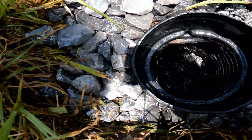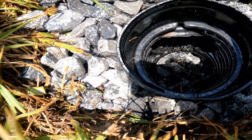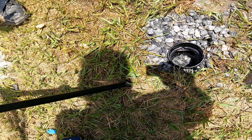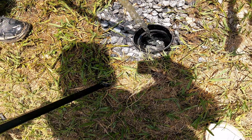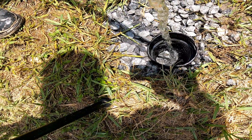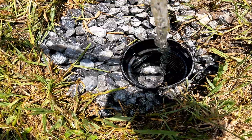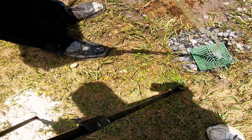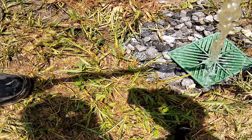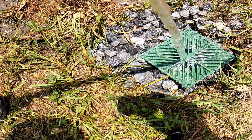Can you see that water coming down the downspout? It just pours into this drain and it will drain all day. I'm trying to zoom in so you can get a really close view — that water is coming from the roof. I've got the garden hose in there, and now I'm just going to put the garden hose straight into the shaft. Look at this — it takes water all day long. Your roof gathers so much water. A 2,000 square foot roof gathers 1,160 gallons of water in every one inch rainfall. I put the grate on the top just in case it ever did overflow — it has a place to come up and go back down into the gravel, down into the shaft, down into the ground.